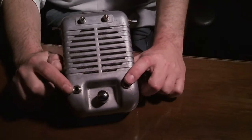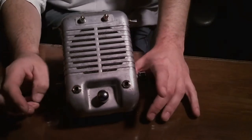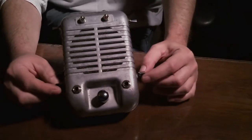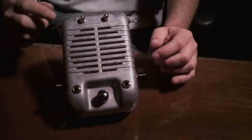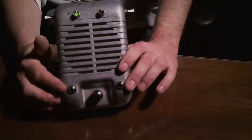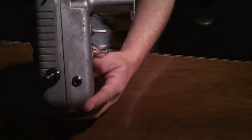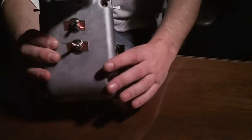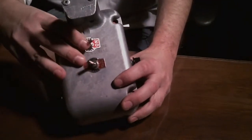What I've got going on here are two inputs — one for a guitar and one for a mic — kind of use this as a busking kind of setup. That goes into an active mixing circuit, so you've got the level controls here for each one. That goes into the preamp, and a 9-volt battery powers the preamp and the mixing circuit together. From there I can just take the preamp straight out through this jack, and I've got these switches on the back which will take the preamp out by itself.